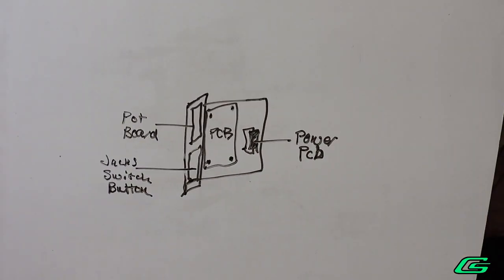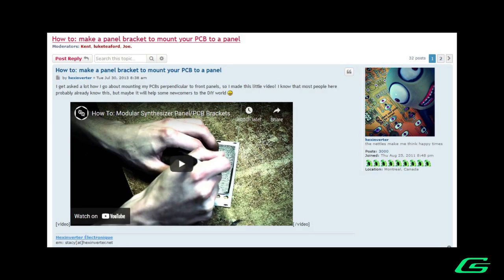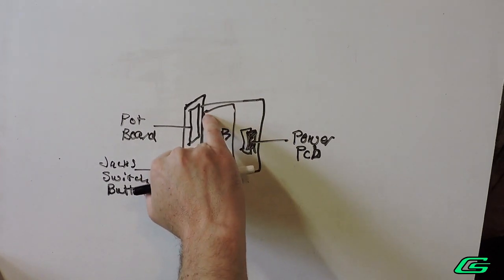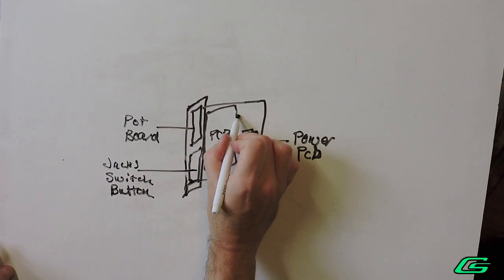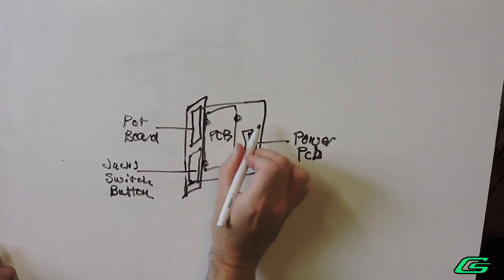Now let's talk about mechanics — how am I going to mount the PCB perpendicular to the front panel? After doing a bit of research and checking the forums, I found a video by Hex Inverter where a cut piece of step flashing was used — I'll post a link in the description. The only problem is the PCB has absolutely no mounting holes. I had some small rubber grommets laying around and glued them in place using hot glue, along with some small spacers to keep the PCB from grounding out on the flashing.